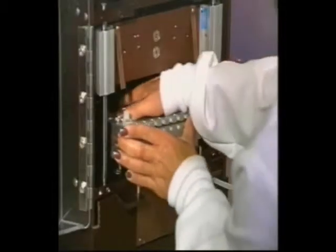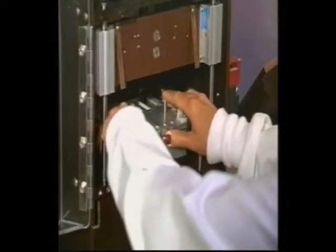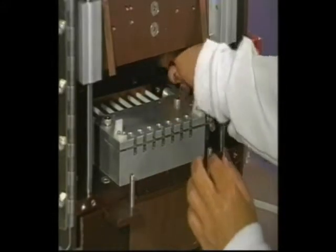To insert the correct size pieces, repeat the process backwards. Start with the new rectifying block. Line up the right side rectifier blade bushing with the center of the cam — this will give you a good starting point. Slide the block around while pulling the ejector rod bracket in towards the front of the machine until you feel the mounting holes for your screws.